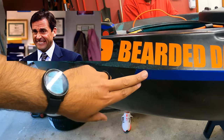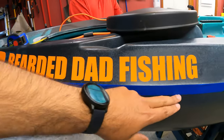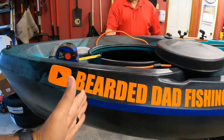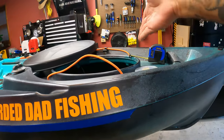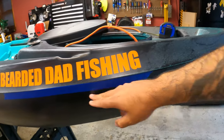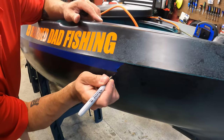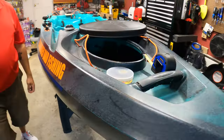Now we're installing the lights going on the bow — the 20-inch green LED lights, nice and long. We're using the one-inch tape and we want to be right below this, so we're the same on both sides, using the front of the hatch as a reference point. Fern got the front done, equal on the other side. We're going to lay these down — my hole is going to be right here and one on the other side.